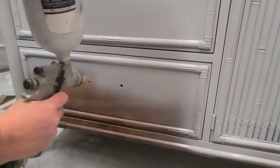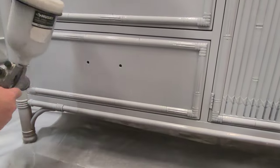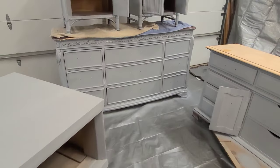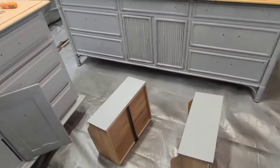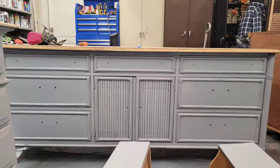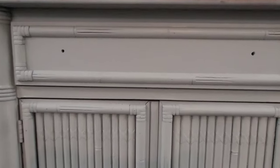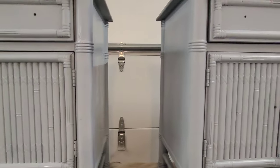I'm spraying with the drawers inside the dresser — the other option is to take them out and tape around the drawer edges, but this saves me time. This dresser is part of a project where I challenged myself to pull a bunch of pieces out of storage and refinish them all at the same time, so all of these were in process at once. It actually saved me a lot of time to spray this much primer all in one day. The tops on these were left unprimed because I have a plan for those — we'll get to that a little bit later.